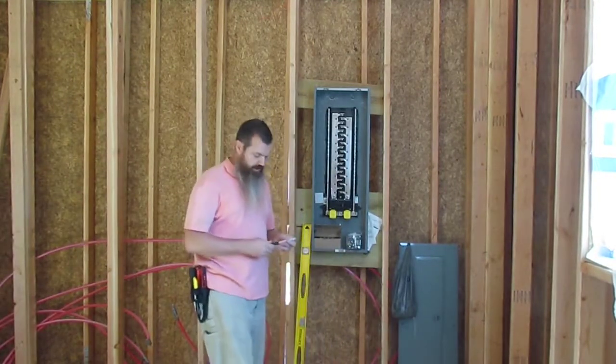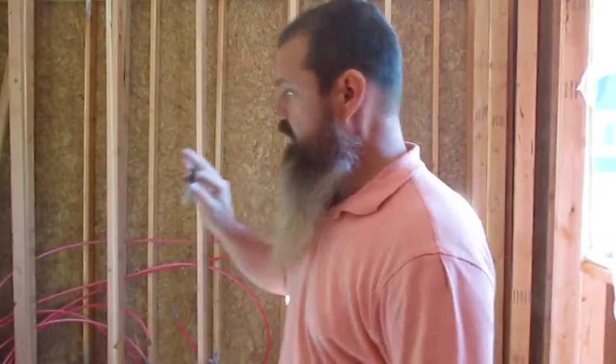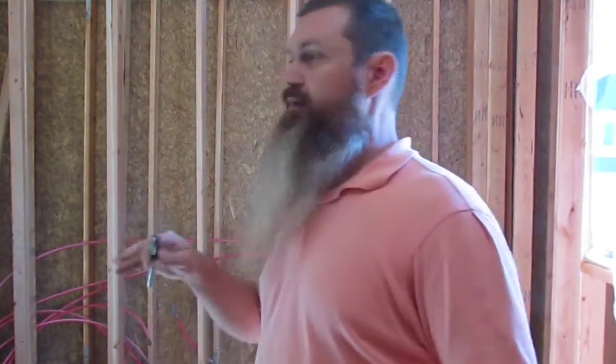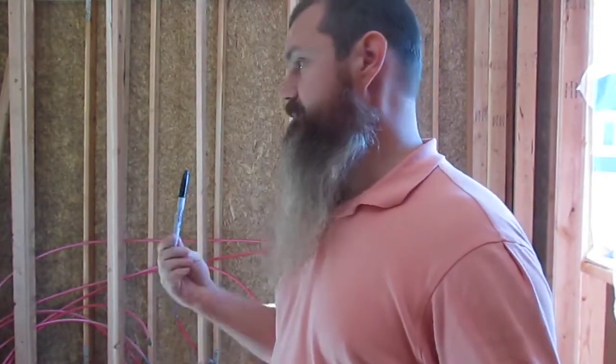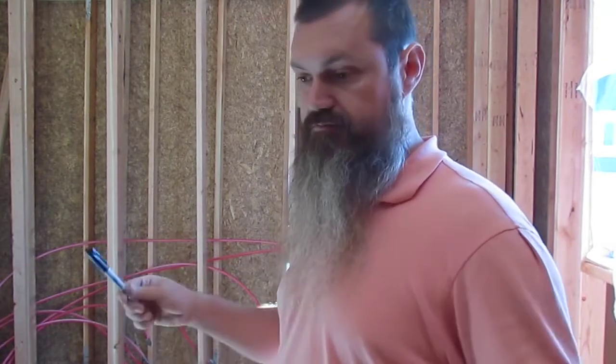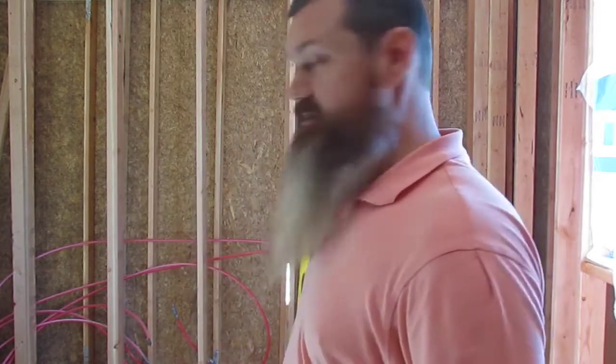Okay, gonna be running some wire today. We got a Sharpie, we're gonna mark each end of the run, whether it's office or bedroom plugs, master bedroom, kitchen, bathroom, whatever. Mark it on this end so you know. Technically, I believe by code you have to have it marked.